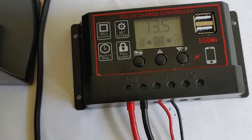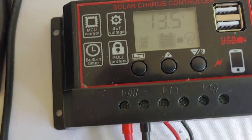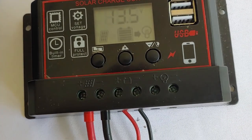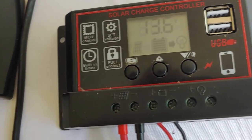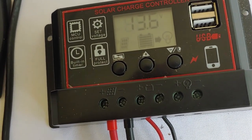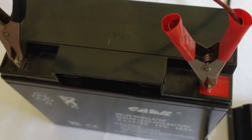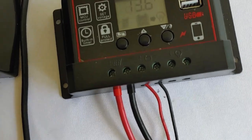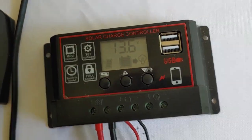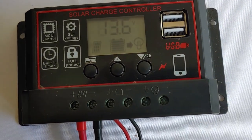The reason is the numbers it gives us for the voltage are not always correct, and it doesn't stay at the voltage you set for it. This may say 13.6 at the moment, and it may actually be. But many times I've come out and checked it with a multimeter and it simply was not the correct number.